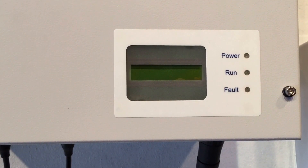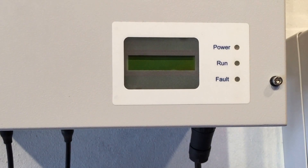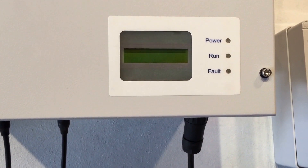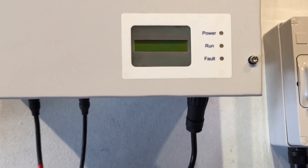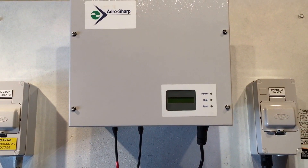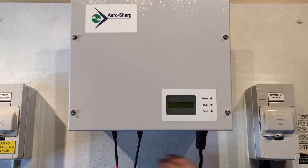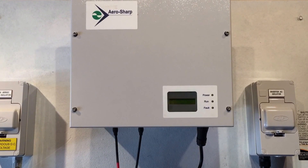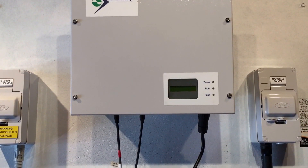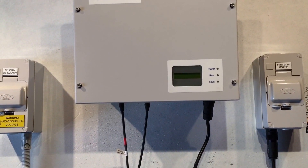So if you've tried this on your AeroSharp inverter and it's doing the same thing, unfortunately you are going to need to get a solar accredited electrician to come and have a look at your system. In this case, I've already checked the system and it is an internal fault with the solar inverter. It does have DC power and AC power getting to it. I checked inside and it does have a 12A fuse which was blown — but that fuse was blown because of another major internal fault.